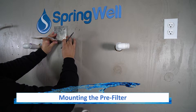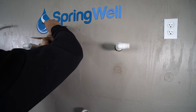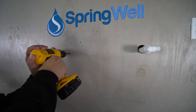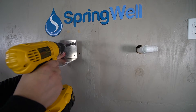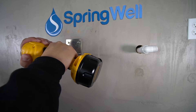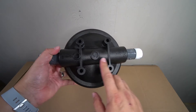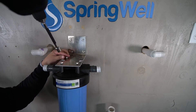Your pre-filter will now be mounted using the provided bracket. Due to the weight, you will need to mount the bracket to a stud. Once you identify the optimal location, go ahead and mark out the holes to be pre-drilled. A 3/16th drill bit can then be used to pre-drill the holes for the mounting bracket. Locate the bag of provided bolts and washers, and then use a half-inch socket to secure the bracket to the wall. Before mounting the pre-filter to the bracket, check the top to identify the inlet and outlet direction to ensure it's properly oriented. It will then be secured to the bracket with four of the provided bolts.